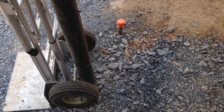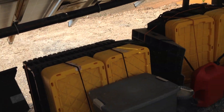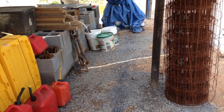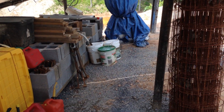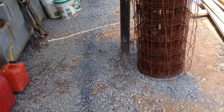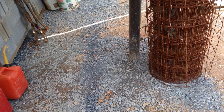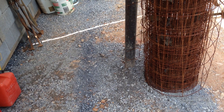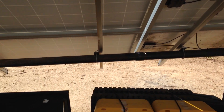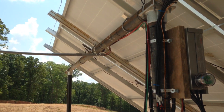They will actually give you the specs on what types of holes to drill and then fill with concrete. This ground is very hard and very rocky — I could not afford to have these holes drilled; it was going to cost at least eight thousand dollars. So what I did instead was just have a trackhoe come out, dig some holes, and fill them up with a large amount of concrete. They're not quite as deep as the specs called for, but since the ground is so hard and layered with rock, and there's about one and a half yards of concrete per post along with rebar, I really doubt this thing's going anywhere. I suspect these panels will tear off before those posts move.